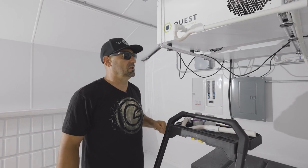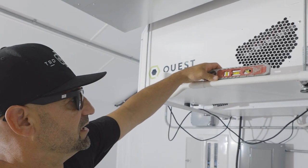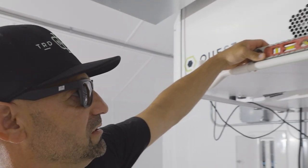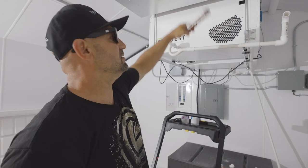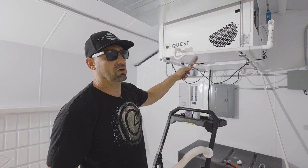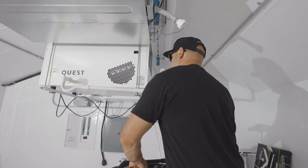It makes sure there's no chance of air flowing back and water sitting inside the actual drain pan of the dehumidifier. I'll grab my trusty level and check to make sure there's slope — obviously you can see there's tons of slope. In this case I'm putting up the air conditioner, the dehumidifier, and the other dehumidifier all with individual p-traps coming off them.